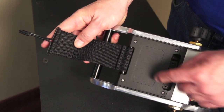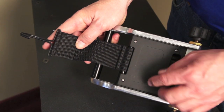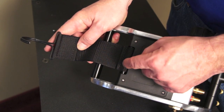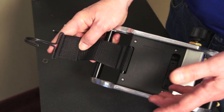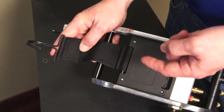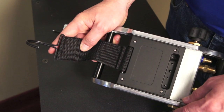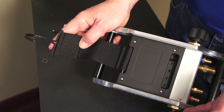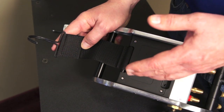One of the last things I want to show you is our hook design. We decided not to go with a rigid metal hook assembly and instead went with a nylon strap — a two-inch nylon strap hooked to a steel rod in the back. When you remove the four screws and open the battery door, you can pop the rod out and swap in either a metal hook or a magnetic strap assembly. A hook works in so many places on a residential unit — screw holes, disconnect handles, or on the grill on top of an air conditioner. We liked the flexibility of being able to change the design, and the nylon strap and hook is what we include with the standard unit.